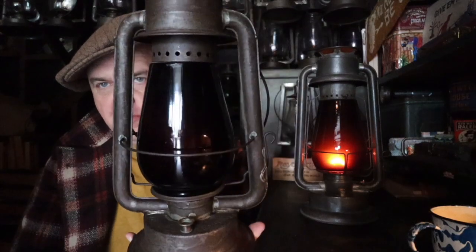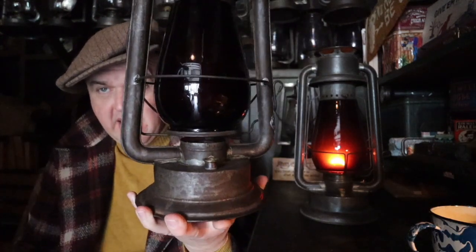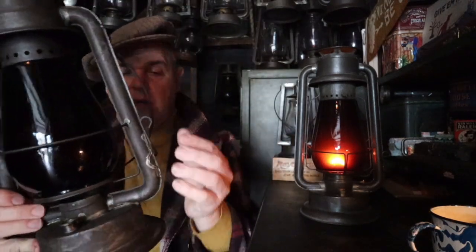Some of the stuff I used on this lantern has been weeping and I didn't wipe it down properly. But this will be a cool piece — I think I'm going to be happy with it the way it is now. As you could see in the previous videos leading up to it, it was being very stubborn. The oven cleaner trash bag trick is definitely very effective. Because the oven cleaner will evaporate over time, if you put it in a trash bag the evaporation is much less — it slows way down and can actually stay on the surface you want to remove the paint from longer, making it more effective.